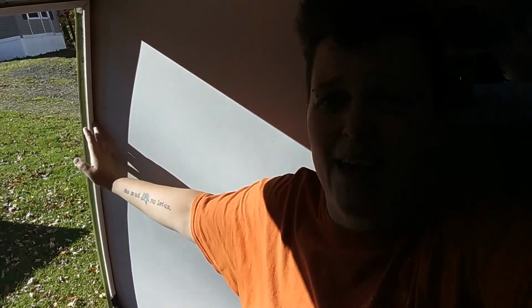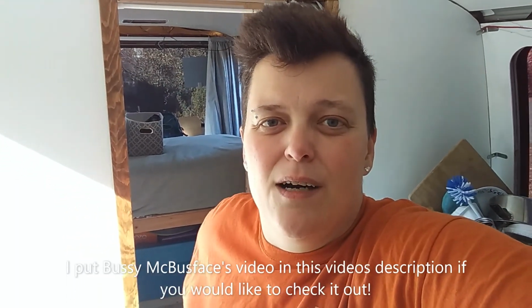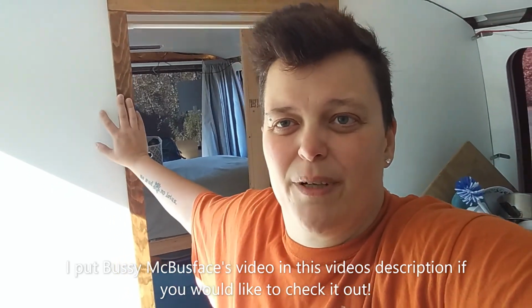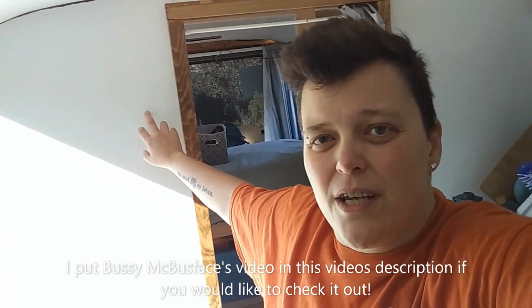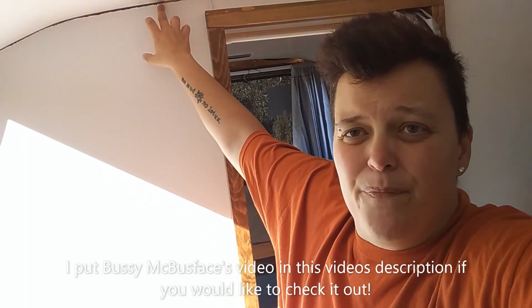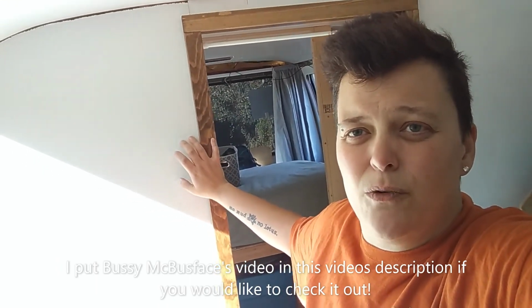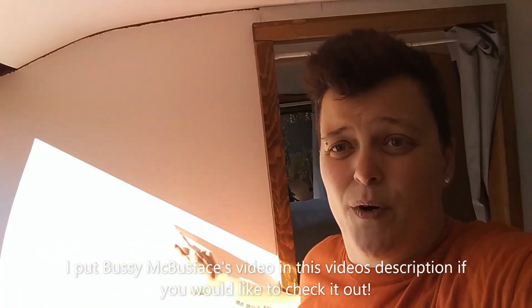Okay, now here comes the fun part. You might be wondering, how the hell do you cut this curve? It's not easy, and it took me a long time to figure out the first couple ones. So I found a great video by Bussy McBusface on YouTube. Mike of Bussy McBusface has a great system where you use a board that goes horizontally, marked at 1-inch increments, with another board that goes straight up, and you use that to measure. So each 1 inch, you go up with the tape measure and you get the height of the curve. It also works this way.